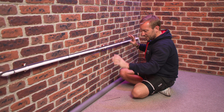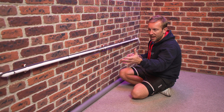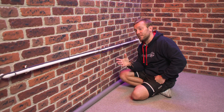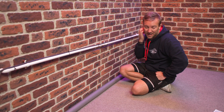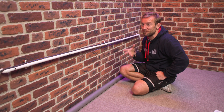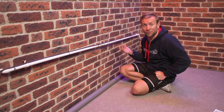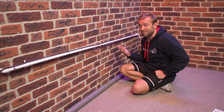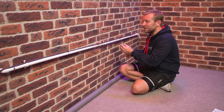This set costs about £30 on Amazon, and then the small amount of electricity it uses — this uses 40 watts. If it was on for three hours a day because it was cold for three hours a day, it would cost roughly 50p to a pound a month to run. How much does it cost to call a plumber out to constantly sort your condense? And if it keeps freezing, it's going to ruin your boiler. It's just quite simple and straightforward.